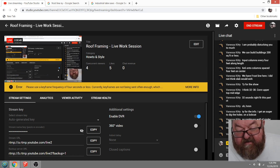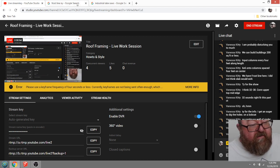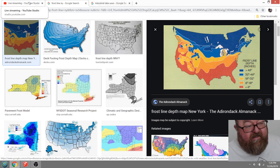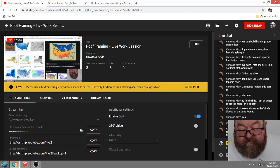Texas is easier. Yeah, in Texas, you probably could do the concrete slab because I don't think the frost line in Texas is very deep. Yeah, it's like ours, 6 inches. I mean, our rule of thumb here is just one concrete block under grade, 8 inches is what we typically make ours, and it's no big deal. And technically, I think the bottom of our footing only has to be 12 inches below the grade, which is nothing. But I go ahead and make them a little deeper. I make it so I have one concrete block underground, under the grade.